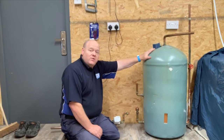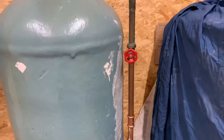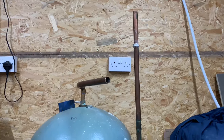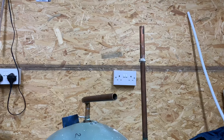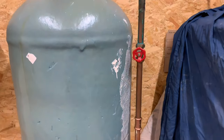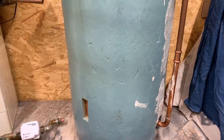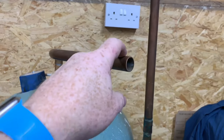On this side here we've got the gate valve. Normally you would have a gate valve coming down from the pipework - it may come down from the loft. You'd have a header tank, usually in the loft - that's the cold water storage tank - and that feeds the hot water cylinder, connecting into the bottom. Cold water goes in at the bottom, and as you draw off hot water, it comes from the top - that goes to your hot water taps.